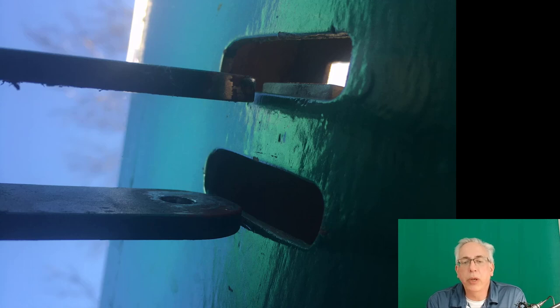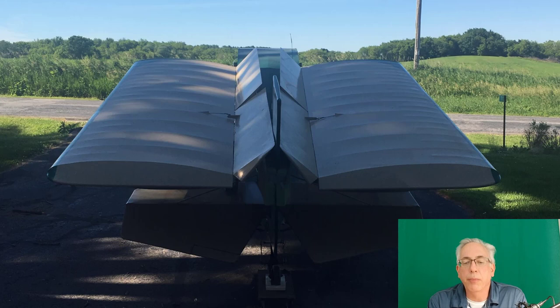I hope that answers your question, Shane. I did talk to you by email, but I wanted to share that because it's common with the Dakota Hawk as well as the Horizon 2, in that the design of that rear pivot on the aft spar, with the hinge point there, causes that arcing and makes it a little bit difficult to get put back together. I hope that answers your question, Shane, and we'll move on to question number 2 for this week.